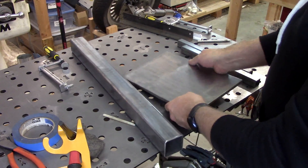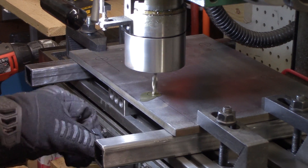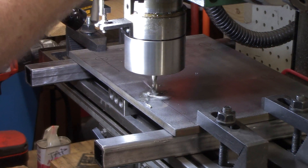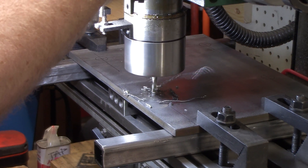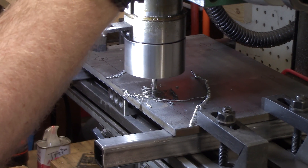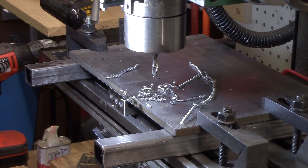The parts were all sanded and cleaned and ready for the next step. I laid out the hole pattern for reference, but I'm not going to center punch and rely on my measurements here. These CertiFlat tables are laser cut to a precision of plus or minus three thousandths of an inch, so I want to get as close to that accuracy as possible. If I'm off on my centers and oversize a hole to get it to fit, the whole fixture can be easily misaligned. So I mounted the plate on my benchtop mill, using a stubby quarter inch bit to minimize wandering. I find drilling steel best when it's slow, cool, and hard — keep the speed low, keep the bit and plate cool using plenty of lubricant, and use a lot of force, using your chip production to guide your force. Slowly push harder until you are producing nice long curly chips, then ease off to maintain a constant force.